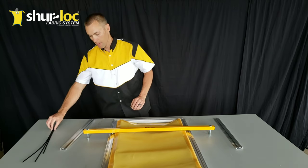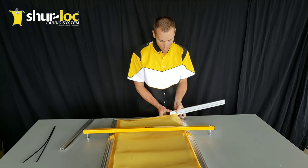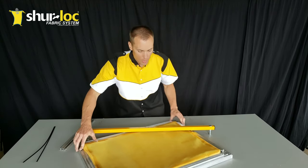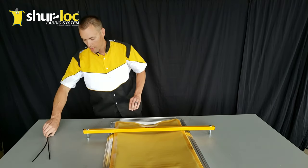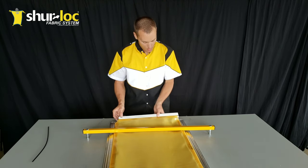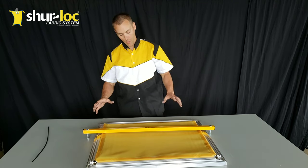I've got both long sides on and I'm only going to hook two on everything to begin with - that's a really important step you don't want to skip. Go to hook number two on the longs. Now we're working on a short end; doesn't matter which one. Simply slide on the tension bar, center up that mesh, center up that rod. Then rotate around to the final end, slide in the rod into the pocket of the mesh, slide the tension bar on, center everything up, and go to hook number two again. Even if you could pull further than that by hand, we prefer that you don't - just go to hook number two on everything.